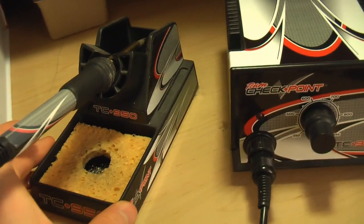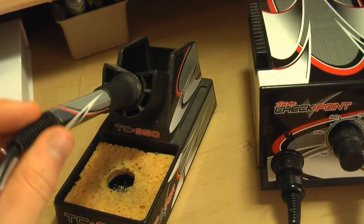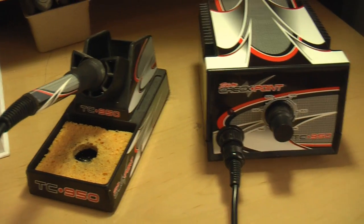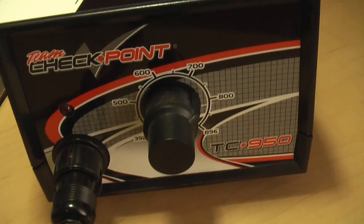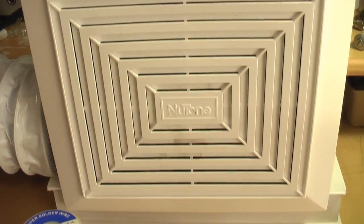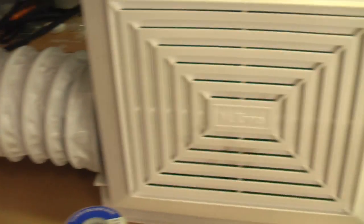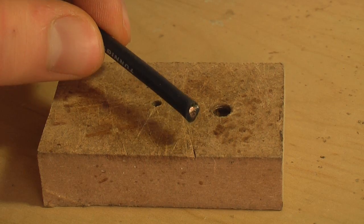Some sort of jig to hold your connector when you solder it. This one I bought from Hobby King for about four dollars and it actually has a little slot to hold the Dean's connector vertically, as you can see there, and also horizontally. I use a block of wood just to cut the wire on and stuff like that. I'm using my trusty old Hakko 936 soldering station — ignore the Team Checkpoint sticker, it's just rebranded — but it's a great station, highly recommended. I have it set to around 750 degrees Fahrenheit. I also have a homemade fume extraction fan venting all the fumes out my window.